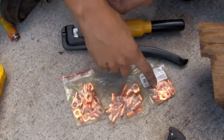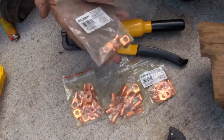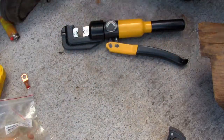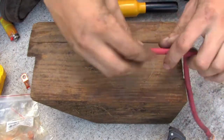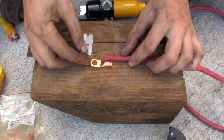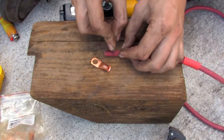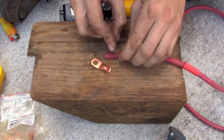You're also going to need ends. I've got a selection of different ends here — I'll make sure there's a link to all this stuff in the description. I believe this one is one of my most common ones; it's a four gauge 5/16 stud. So we're going to snag one of these, push all this stuff aside, and then you're going to need a means of trimming the insulation off your piece of wire. Get an idea of how much you want trimmed off by lining it up — somewhere about there. If you get it spot on, it makes the crimp look a little nicer because the insulation just butts right up to the back of the terminal.